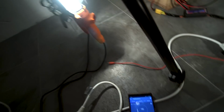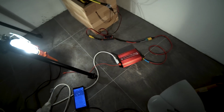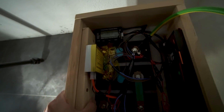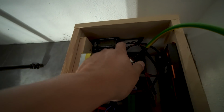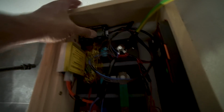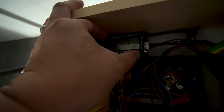And as you can see, I'm using more watts now, 207 watts. That's because besides these two lights, I've added this one. That's only a 40 watt bulb because it can only handle 40 watts. Battery, everything's staying cool. I'm not drawing very much. And you can see here 13.03 volts. The delta from high to low is 0.039, still pretty low. The high is 3.214, low is 3.183.